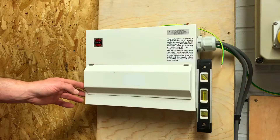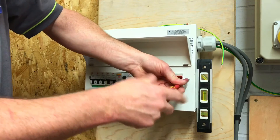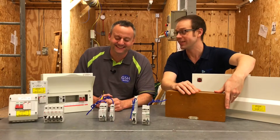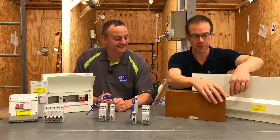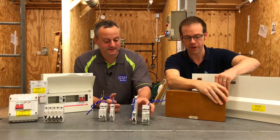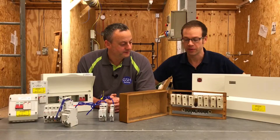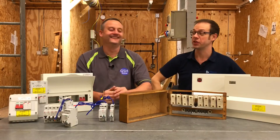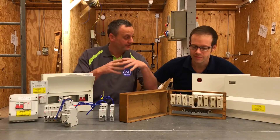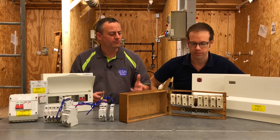But as you say, perhaps there are some safety issues here. We know that to enter an electrical enclosure we must use a tool or a key. So how was it entered when it was completely intact? There was a little hook on the side — the hook's gone now, so it's even less safe than it was before. That little hook simply undid with no key, no screwdriver, no tool beyond your finger, meaning you could very quickly and easily access the internals of this consumer unit. Quick access into the live parts — possibly not the best thing in the world. We're used to taking a Pozidriv screwdriver on a domestic consumer unit after a safe isolation procedure, or using a key on a more industrial-style distribution board.